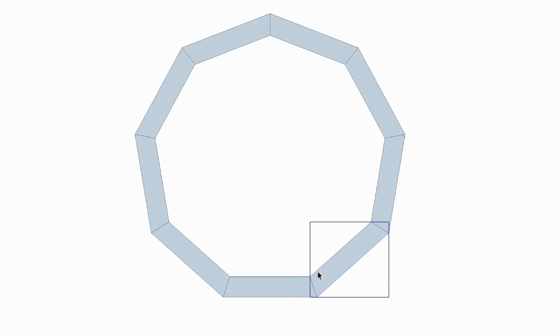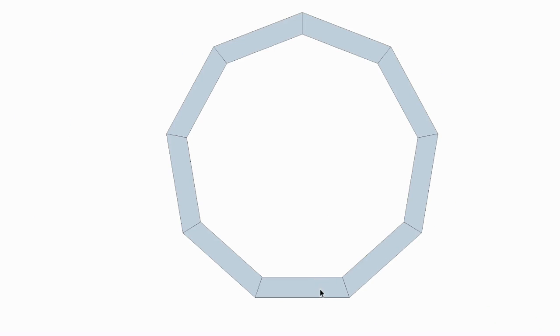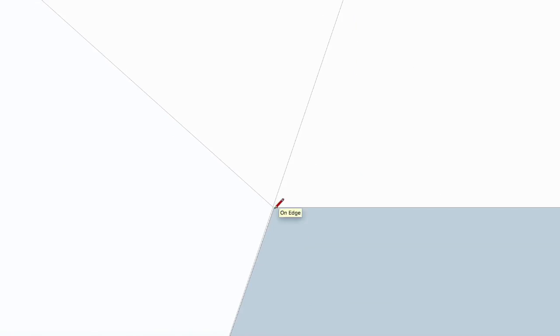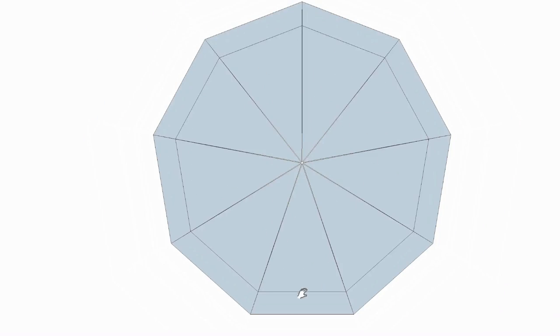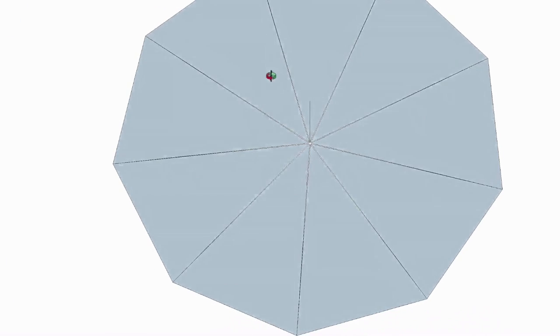Here's a segmented ring with all the angles on the segments cut absolutely perfectly. Now if I bump those by just 0.1 degrees on all the segments — a tiny little error — you really don't see much of a gap in a ring. That performance would make you quite happy, well within accepted woodworking tolerances. But if you extend those same lines in so that you have a pie-shaped situation, the gap becomes quite a lot more visible because that error is compounded across the length.